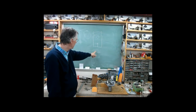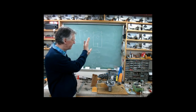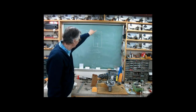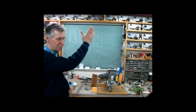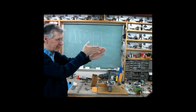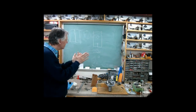And the way you do it is you line it up using this little offset eccentric pin here that allows you to tilt that to get the axes to line up. And so as your tip wears down, then this is in line with your 90 degrees, or 180 or 270 or zero, and it doesn't skew off axis as it wears down, so you don't really see that much of a quadrature error becoming wider as it wears down. Okay, that's all standard stuff.